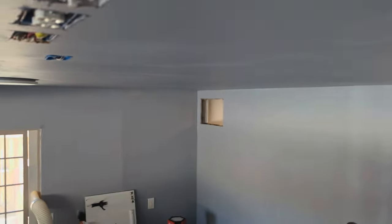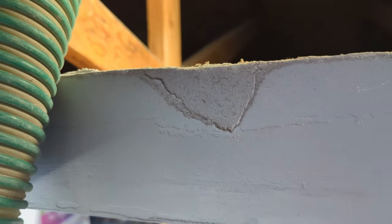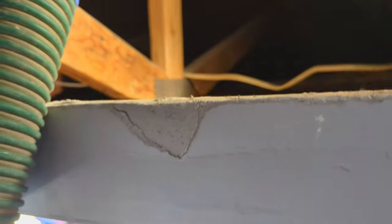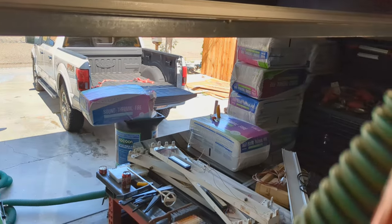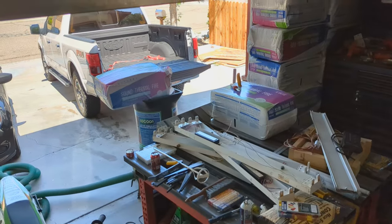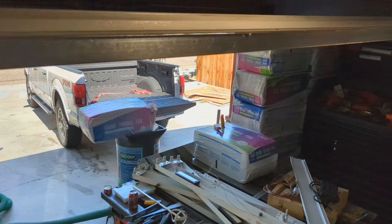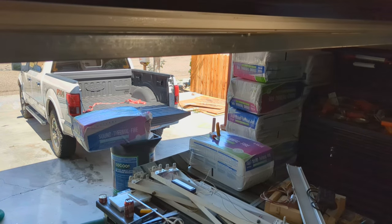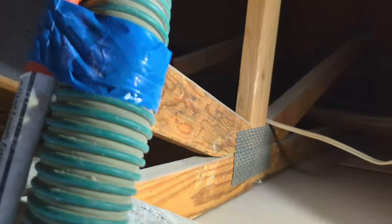While you blinked, I put in lights and painted the whole place. It's probably a solid B for drywall quality, but if I paid someone to do it it probably would have turned out better — but not two thousand dollars better. Now we have this blown-in insulation machine and all these packs of insulation. I decided to blow it in because each bale was about $15 and covers the most square feet rather than paying $70 for 20 square feet, with the same R-value. We taped a broomstick to the end of the hose so we can reach way over into the corner without having to crawl through the attic.